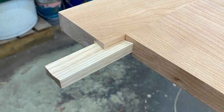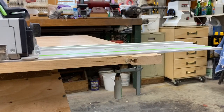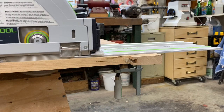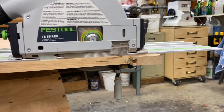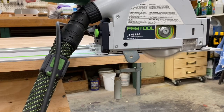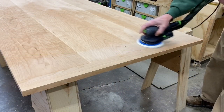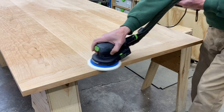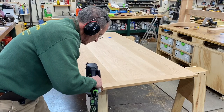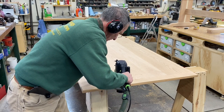Here's the detail of what the ash key looks like before I came along with my track saw and made a slice down each side and trimmed it up. That ash dovetail key was a fair amount of work, but I really liked the way it looks on the table. Once the top was constructed, I turned to my finishing tools — I used my sander to sand everything down and then my router to put a round-over edge all the way around the top.